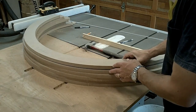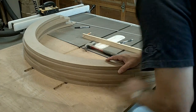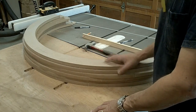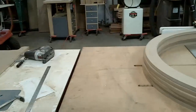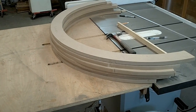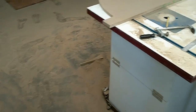This is the first one I cut. I'll trim all the other ones to the exact dimensions with this outside one using a pattern routing bit. I also want to talk again about MDF — after I cut all this out using an air filter and my dust mask with a door and window open for cross ventilation, there's still a lot of dust all over the floor and a fine coating over everything in the shop. Safety is very important for your lungs — please make sure you wear a dust mask and have some kind of filtration or cross ventilation. Very messy business, MDF.